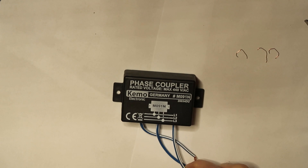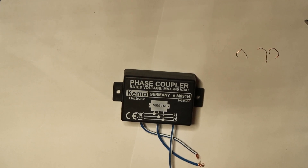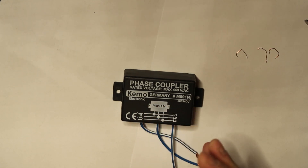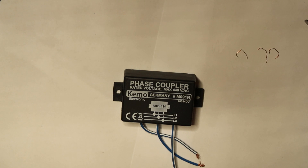You have to install it after the circuit breaker, not before — if something shorts in this part, you need the circuit breaker to trip and protect you and your house from fire. Be very careful, and I suggest not installing it alone unless you are familiar with all the dangers involved. That's all, thank you and bye.